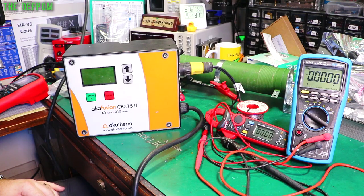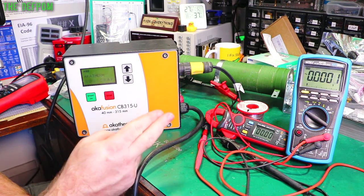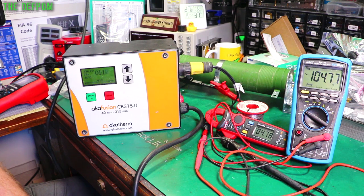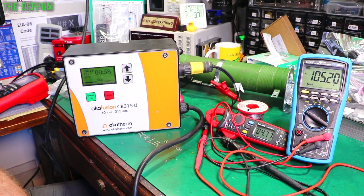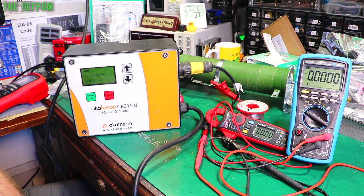Right, ready to try this again. I've got the power plugged in - let's turn it on and see if everything goes bang. Will it work this time now I've replaced that resistor? Yes it will. There we go - 4.8 amps putting out, 104 volts. Let's do a whole weld on this thing. See if it does a whole weld okay. Doing good so far. 20 seconds to go. No problem there. That weld was successful. I'm going to let it cool down and do it again just to make sure it's definitely welding okay after repeated attempts. But it looks like it's probably fixed too.